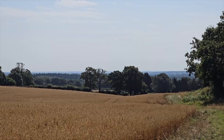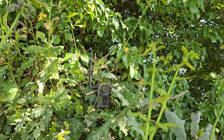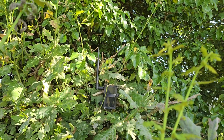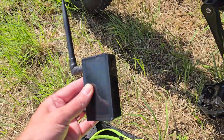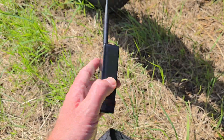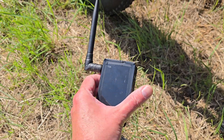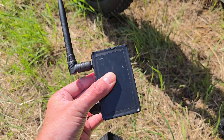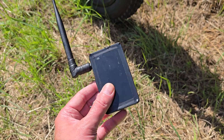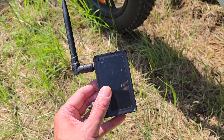If you've come across that on Meshtastic, here is the node itself. I need to whip the battery out and change it — it lasts about a week or so. These are my test nodes, my temporary ones for scouting out new locations. Very small, it runs on a 21700 battery, super compact. It's got a Raspberry Pi Pico in here and I've got a little method of swapping the batteries out on these cases which doesn't make it too much hassle.